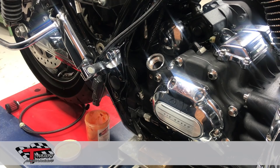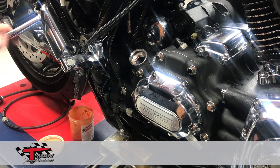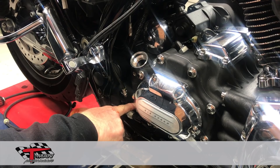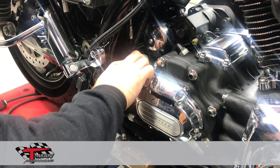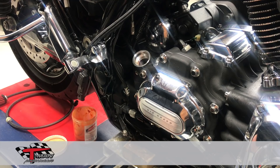How this works is you're going to take your dipstick out. Now this can be done without removing the oil pan if you just take your time. What we do is take two pieces of paper towel. You have a baffle in here, so there's no chance of these falling in where you can't get them out. We press a couple pieces in there below where we're going to drill the hole so that your drill does not catch and tear them up.